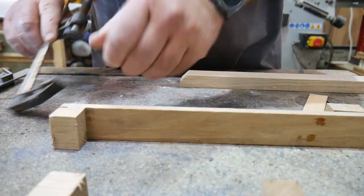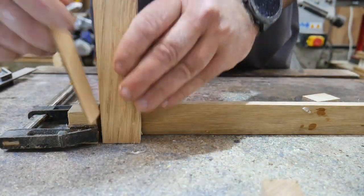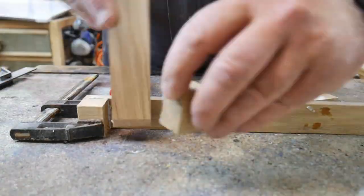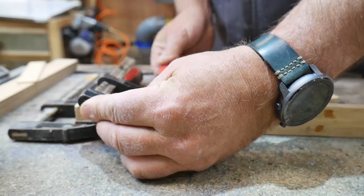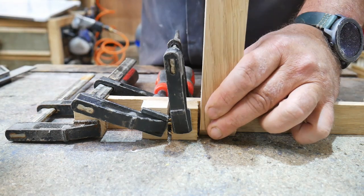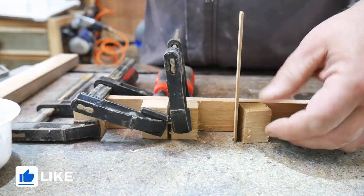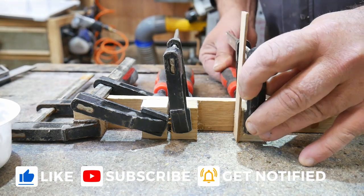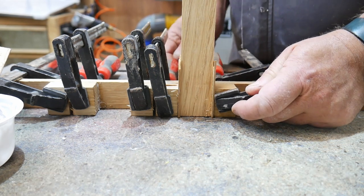Apply a little bit of glue onto the end of that piece of wood. Use a spacer and then clamp the second piece of wood - I'm using these little F-clamps which do a fine job. You need to make sure you've got clearance, otherwise if the shoot bolt expands in humidity it will jam up solid. There we go - all three saddles, all cleats, all glued up and ready.